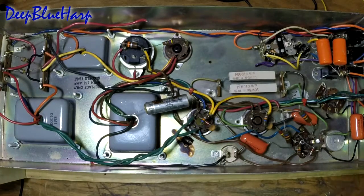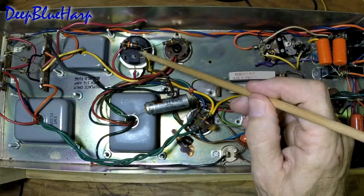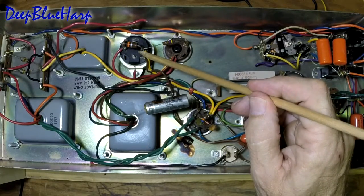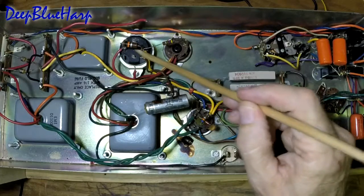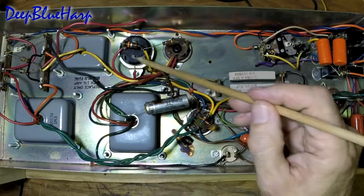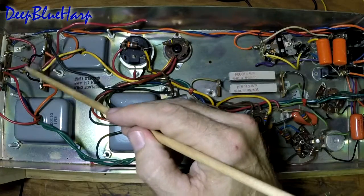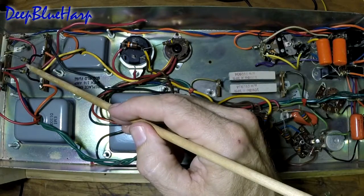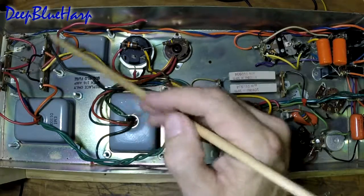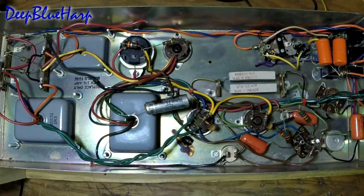The other two sections are definitely shorted out, which is why I keep blowing the slow blow fuse mounted here. It costs a whopping $37 to go buy a new can capacitor for this unit. I will install it and retest the voltages again. If I get voltage with my slow blow fuse reinserted, I'm going to put a holder either here or here for that fuse. Then I can do the voltage check and I'll share those with you in the next video. Thanks for watching.